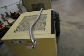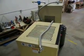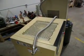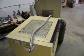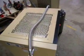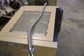Going up on a ladder to show the top of the unit. It is very important how compressors exhaust air so it does not blow on any of the work you are doing. This unit exhausts straight up in the air, which is excellent — the best way to exhaust. You can actually heat your building with this air if you put a duct on there.